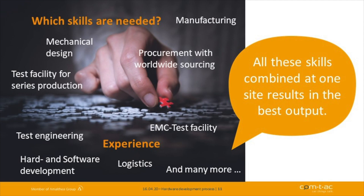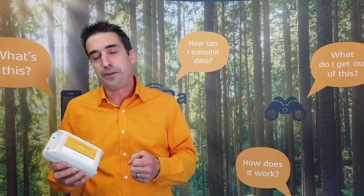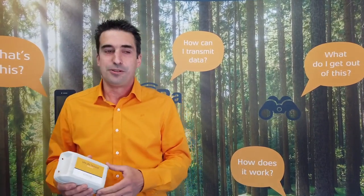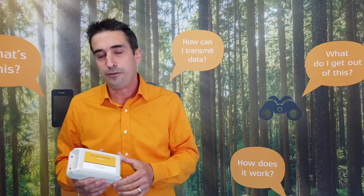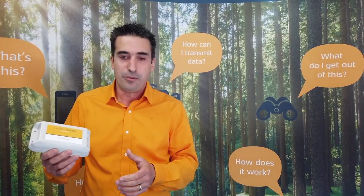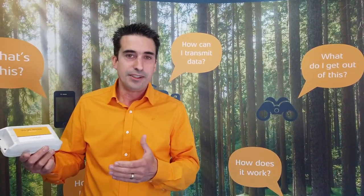And even if you scale up and roll out, let's say 1,000, 3,000, 10,000 devices, be really careful about the amount of time you need there for the installation process. So it's really extraordinarily important that you think about the whole life of that. And even in the field, if the battery lifetime becomes only 1 year, think about the time you need to replace the battery 10,000 times for your devices. It costs you really a lot of money to do that. And for that, it's maybe more important for you to spend more cost on a bigger battery to reach that.